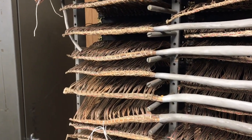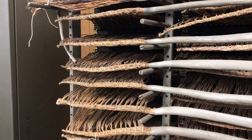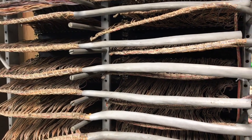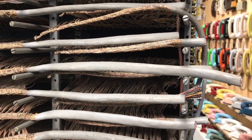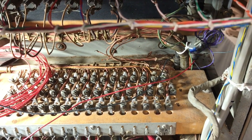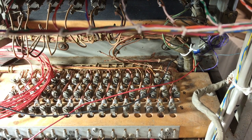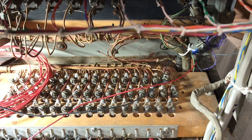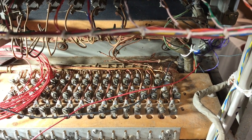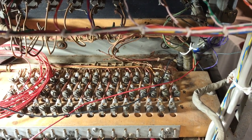One of the other issues when dealing with wire this old is that it's very brittle and badly faded, so unless I strip the gray jacket off the cable pairs, many wires are close to the same color. That means I have to buzz them out with a toner, which is a real pain but has to be done. Another challenge is that the brass screws on the terminals have been tightened down for 30, 40, or 50 years, and when I go to loosen them, the heads are breaking off — which means I have to work out the broken screw and replace it, a real pain due to access issues.